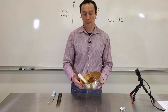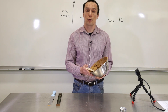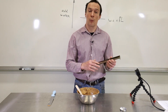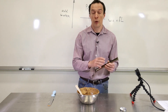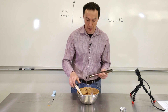We need to prepare the soil — the clay. We mix it with water content that is equal to its liquid limit, and then we use this mold. We put some grease inside the mold so that it's easier to place the soil and remove it. We're going to put soil in the mold and dry it up naturally for a few days.